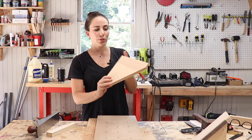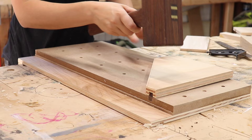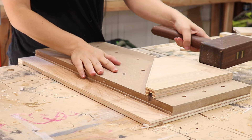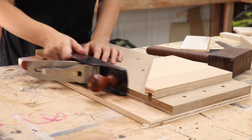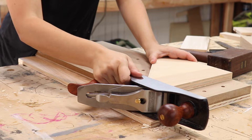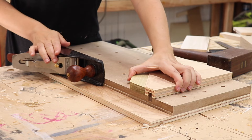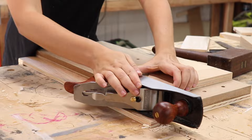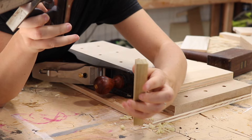The next attachment is the miter attachment — just a piece of plywood with a dado in the back and a 45-degree cut. It goes into the shooting board and you can tap it into place. Because of the inset to keep the ends clean, you have to line it up with the back of the plane rather than the edge. You just take the miter you want to perfect, hold it in place, and shoot away — a perfect miter both ways.